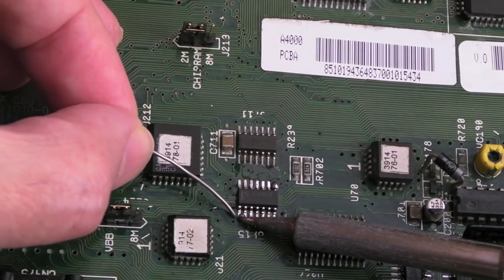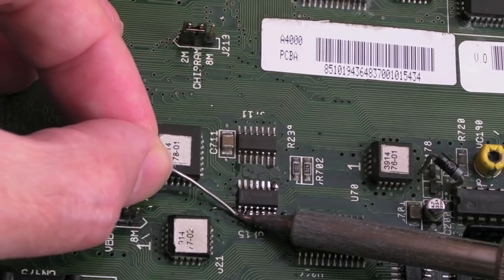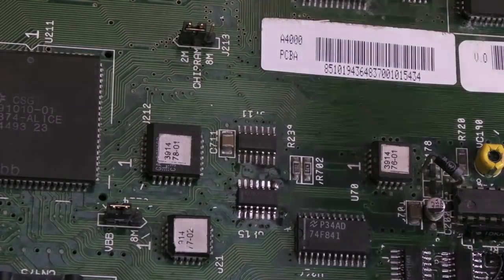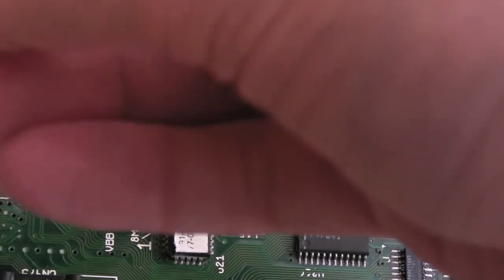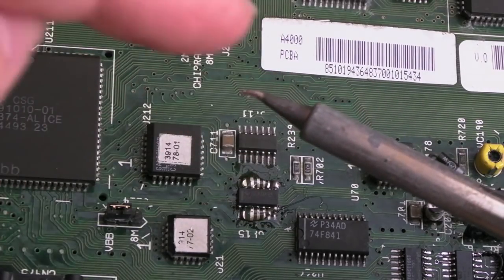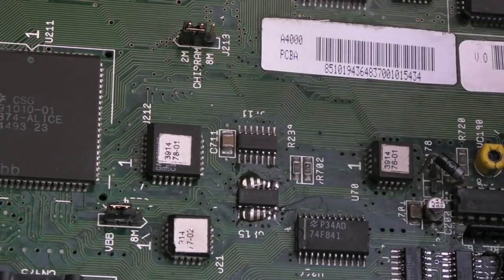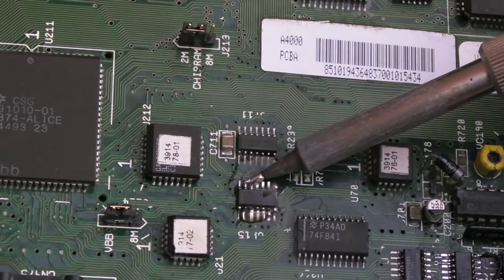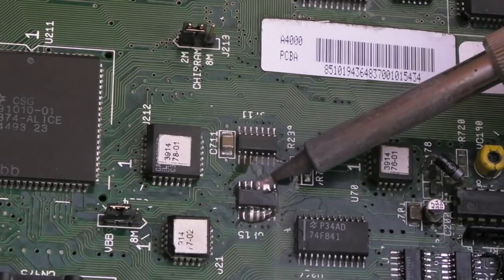It's got like a hook, this tip here. It's like a little point. Makes it quite hard to reflow certain types of points here. You can't solder as easily as you can with a wedge type tip. But anyway, that's it, it's secured, so I can just add some more flux. The big problem with this tip, can you see, it's like a hook, a little point. It's so thin, but the solder accumulates at the top of it anyway. When I need to reflow this now, you'll see the solder, oh there, it's flowing a bit, but it doesn't always flow very well down the tip. There's a lot to be said for having the right tip for the job on hand.